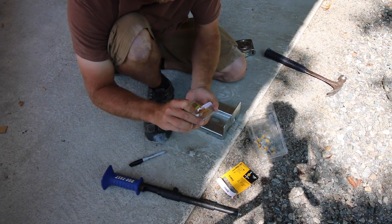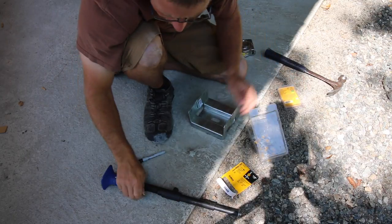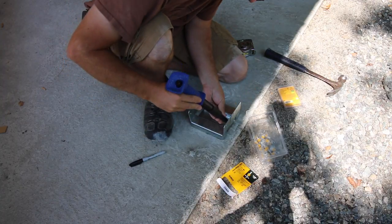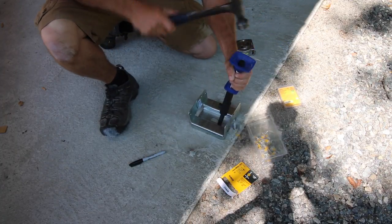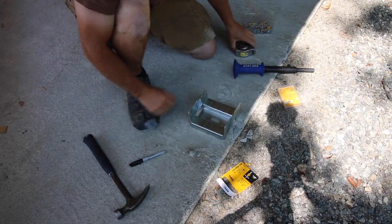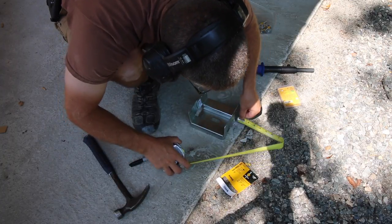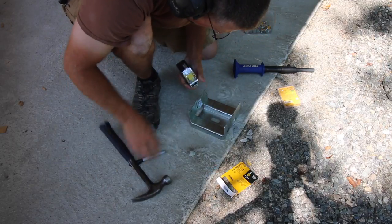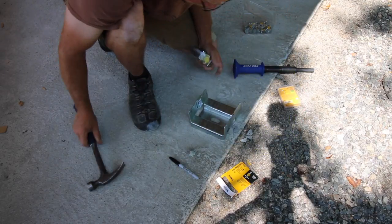Put your nail in the set driver — it's got a little rubber piece. We got the one with the washers. Then you have your blanks — it's like a bullet but without a bullet, it's just gunpowder. Load it in — this is a slide hammer. We're gonna set it in place, take our hammer, and give it a good solid whack. Boom — just like that. Gonna remeasure everything and make sure nothing moved on us. Inch and a half, inch and a half — nice.